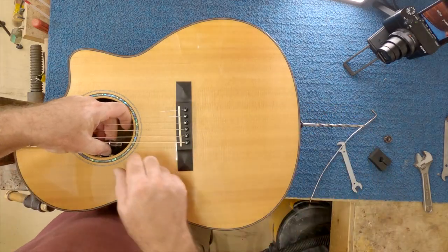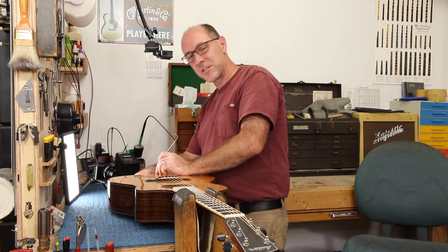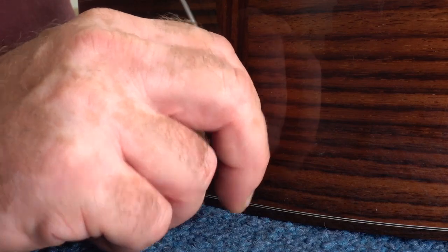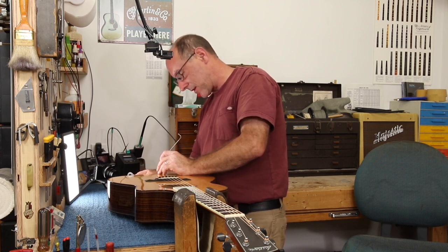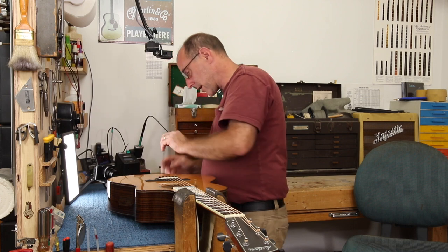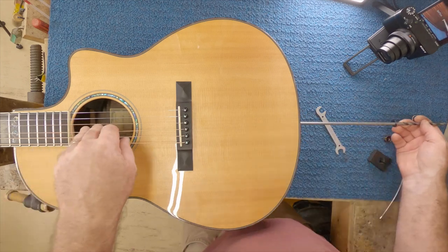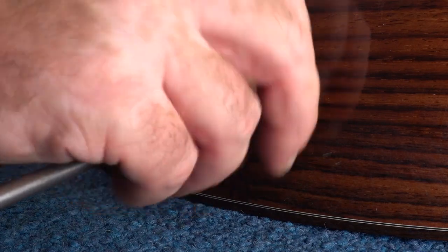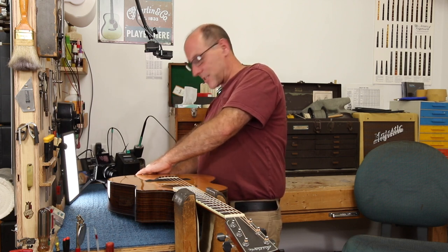We just loosen the nut back up, slide it out, and bring this nut forward again about a full turn. It's really starting to — so close. It was just starting to snug up against the sides, but it's just a hair too loose. When it hit that large diameter, you could almost leave it there, but I don't want to. There's no excuse for leaving it close enough when it takes so little to make it entirely right. A little bit more than a quarter — about a third of a turn, roughly. There's a little bit of wiggle room with that star washer on the inside; it absorbs some of the compression when you tighten. You can be off on these plus or minus a half a turn, really.